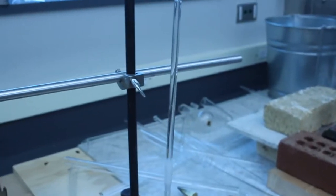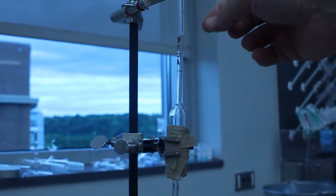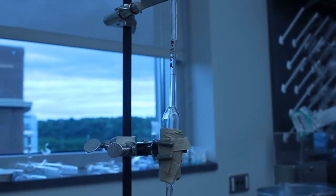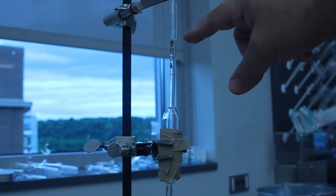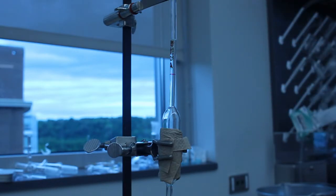And as I do this, I'm going to be using the hand torch to make the seal. So I'm basically going to put these two pieces of glass tubing together, have them in proximity, and then go ahead and make my straight seal or my butt seal that way. And the reason I'm doing it is if I try and bring the glass tubing together like this, the way you normally do it, I am very worried that because of how small this diameter is, 7 millimeters, that I'll get it off center and just make a mess of it.